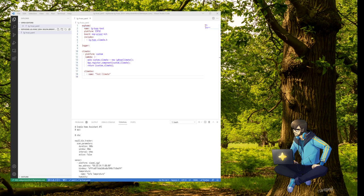So this is going to be interesting because sensor is not the problem. The problem is going to be, how do I get this to actually know when it's time to update? Because I could use a polling component for reading the temperature out of the control panel, and I can definitely use a polling component to go and send the update to the HVAC. Because as far as I can tell, the moment when I disconnect the control panel, the HVAC is just completely quiet. So if I inject my polling component and every 1 second I write, that should work perfectly fine.